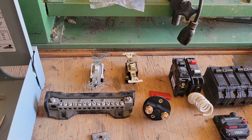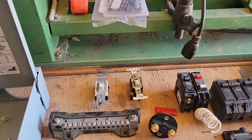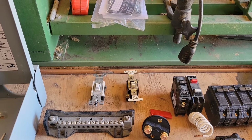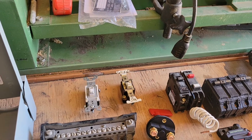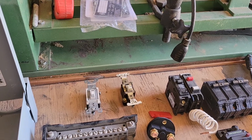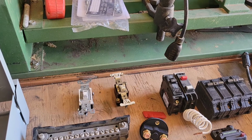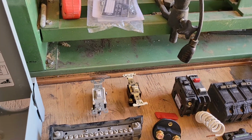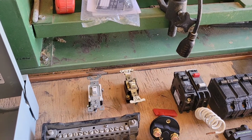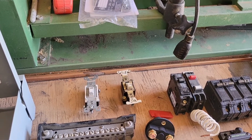What is a shunt? You'll hear shunt when you're talking about usually residential solar. A shunt is basically either a manual or an automatic one, and they usually use an automatic shunt in residential solar for on-grid connections. And what it does is, if the power goes out from the electric company's power coming into your panel, it disconnects your solar from your panel so that you're not backfeeding electricity through the whole grid while some guy out there is trying to work on the pole, thinking that his boss has shut down the grid in that area so there's no electricity there, so he doesn't get electrocuted.